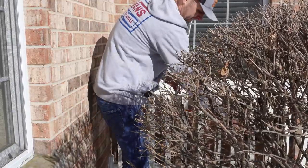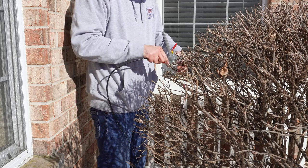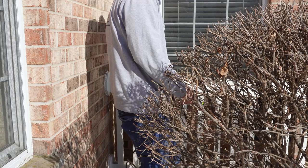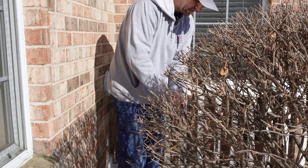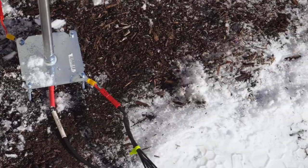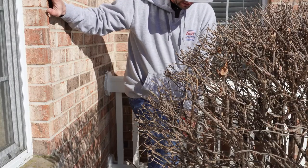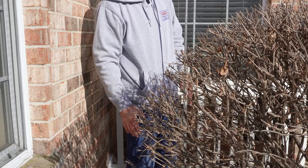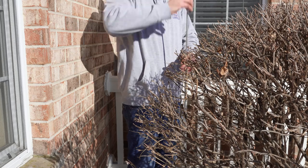I've got the antenna on and the ground plate ready. I'm going to put the coax on first because it's much easier than trying to dig under the plate later. My radials are going out that way. To put it in the ground, you could either get on your knees and push it in, or just lightly step on each side, a little at a time, gently pressing it into the ground. Then we'll put the antenna up. This is a perfect spot — hidden by the bushes, so if the HOA comes around, she'll never know. Let's go check the SWR.